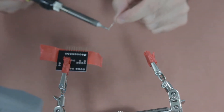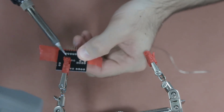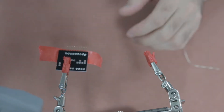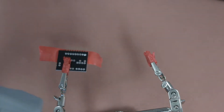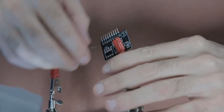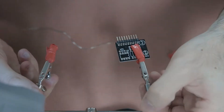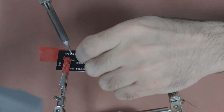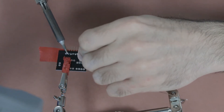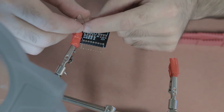If they don't sit quite right, once you solder them to the main circuit board they might tilt a bit too forward or back, creating problems with other components. So make sure you tape them down to hold them in place, solder one pin first, then check the orientation to make sure the header is nice and flat and straight on the PCB. Once you've confirmed that, you can solder the rest of the pins. Next up, we're going to put a bunch of smaller components on this PCB.